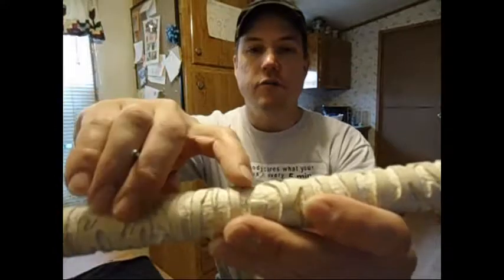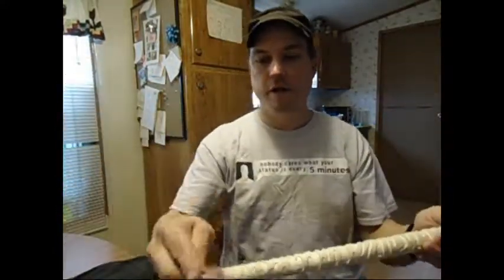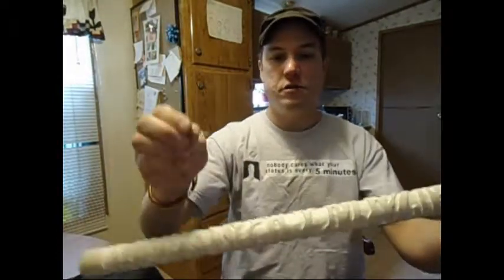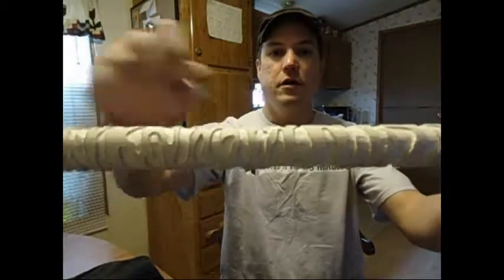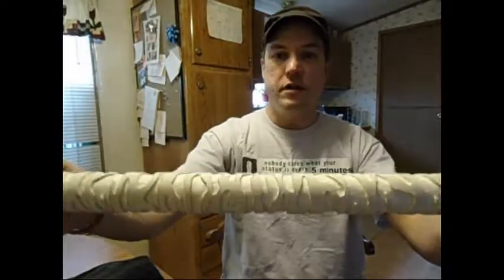Well, I've been working on it for more than a few hours, and the last time I showed you, it was all carved out. I went around with a round bit to carve out the majority of the wood that I needed out, but it's really sloppy, you know. And I went back with this bit here. It makes a more square edge, and that's what it looks like there. See, it gets in there, it takes that rounded edge out, and it cleans it up really nice.